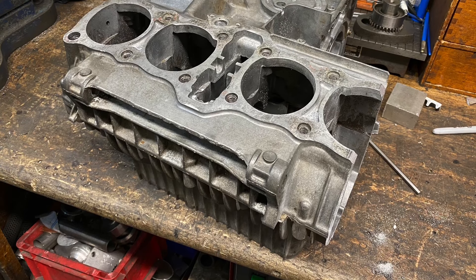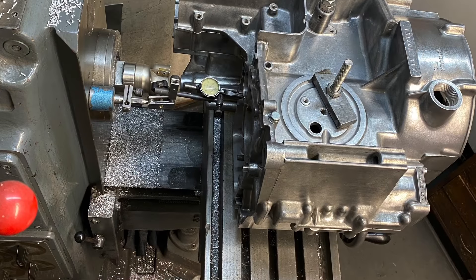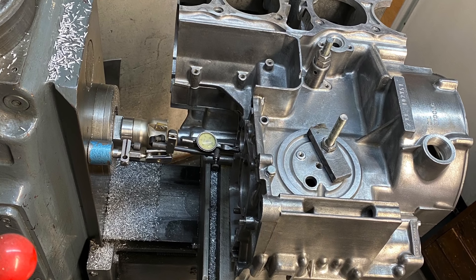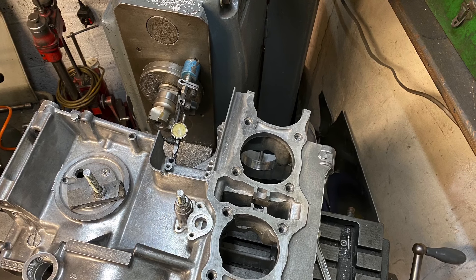The central crankcase has its left-hand side cut off ready to accept the new piece of casting. I put this on my miller machine and clock up surfaces with my DTI — surfaces that were machined at the factory in Japan — to make sure that my new surfaces are also square.